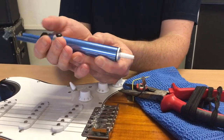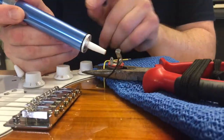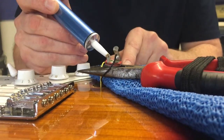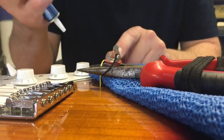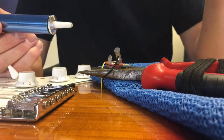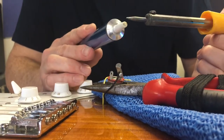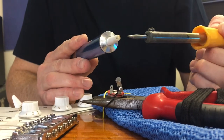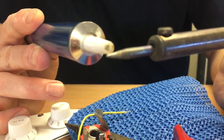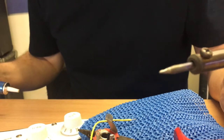So it's quite a handy gizmo. Once you've heated the wire up or any excess solder with the soldering iron, prime it, and once it's warm push the button to remove any solder. The iron is nice and hot, so be careful - you can burn yourself. If you look at the tip of the iron it should be nice and shiny - it's called tinned. When the iron first heats up you apply solder just to the end to get a nice shiny surface, which means that the solder will stick to the job and not to the iron.